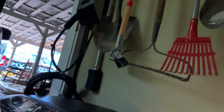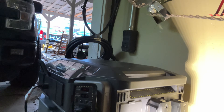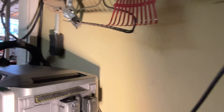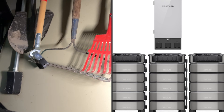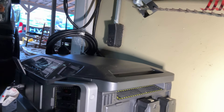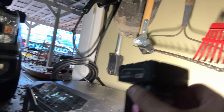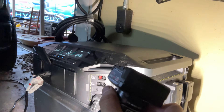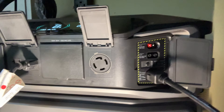The better part of this is that it's very versatile. You can stack five of these batteries — this is just a battery and they connect right here — and use this one inverter. You can get three stacks of those with a power transfer switch. It's like a breaker panel but it's a transfer switch, and you can power your house with that and use it as backup power. The transfer switch has a grid-tie inverter; this inverter here is not a grid-tie inverter. So with the transfer station they have, this becomes much more versatile.